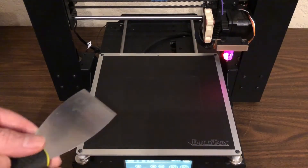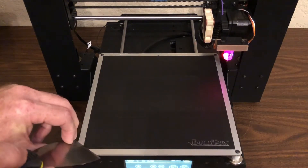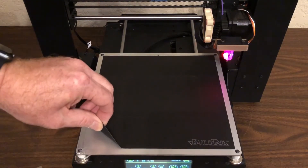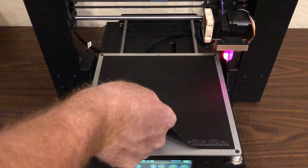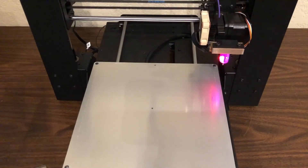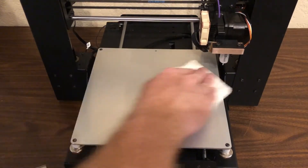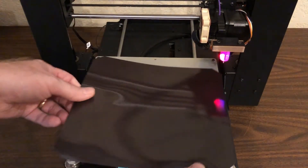It's time to get this installed. Before we can install it, we need to remove the existing build surface. The easiest way to remove an adhesive-backed build surface is to heat the bed up to about 60 or 70 degrees C — that loosens up the adhesive — and then start peeling up a corner with a scraper. It's just like peeling a price tag off something. Go slow and you can get the whole thing off without leaving any gunk behind. The sheet I'm removing is genuine BuildTak, and it's great about being removed without leaving residue. But I'm testing the Creality C-magnet on my other Maker Select Plus, so I need to remove this to install the Wham-Bam system. Now we need to clean the heated bed with some isopropyl alcohol and a paper towel to remove any sticky residue and get the heated bed ready for the magnetic base.